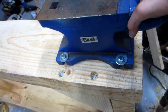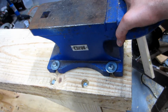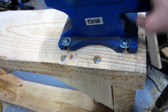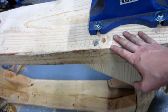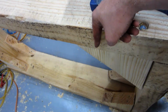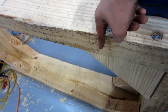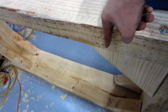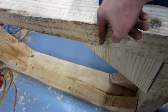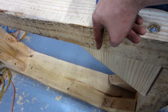The other thing is that you can build with nails using wet wood that hasn't been seasoned, but there's not really any incentive for them to stay in the wood. Although it will shrink, it can crack just as easily as a screw. And other than shear force preventing it from wanting to move this way, there isn't much to keep it in so that it doesn't back off. Probably what would happen is it will back off a little bit as it dries, and you'll lose some depth.